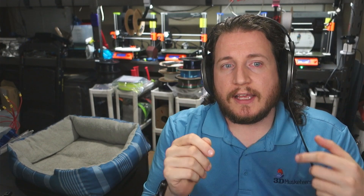The nice thing about a flex plate is that you can put it on, take it off, put it on, take it off. There is a value in being able to do that. Not only can you just have spare build plates so as soon as your print is done you pull that plate off, put a new plate on, click print — but it also ensures that stuff like this doesn't happen. Those plates are normally made of spring steel, and that spring steel doesn't shatter when it hits the ground. It could potentially get a bent corner, but with the magnet holding everything in place, you shouldn't have that problem either.